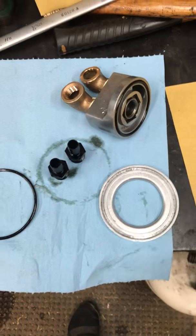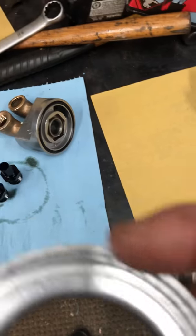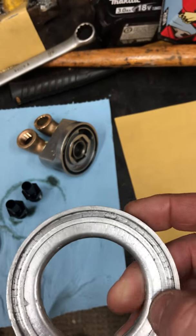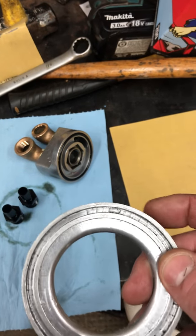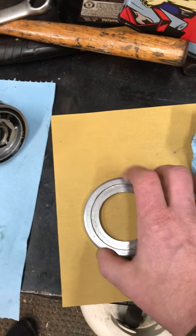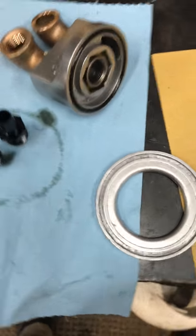I was a little scared about filling it with RTV and squishing the o-ring if I didn't have to, so I put it up without any sealant and it started leaking. I took a little bit of fine sandpaper because I noticed it was humped up at the outer edge — I thought maybe that lump of aluminum was touching the block before the o-ring gets squeezed and seals. I put it on the sandpaper and gently knocked that down to get a pretty flat plane.